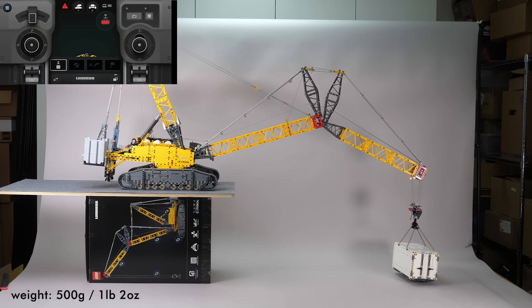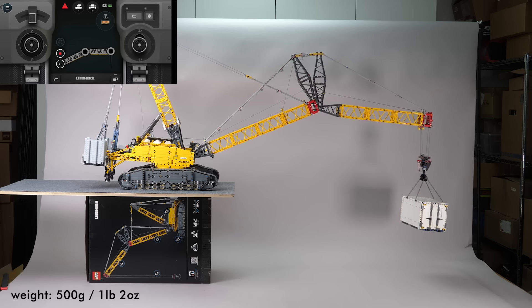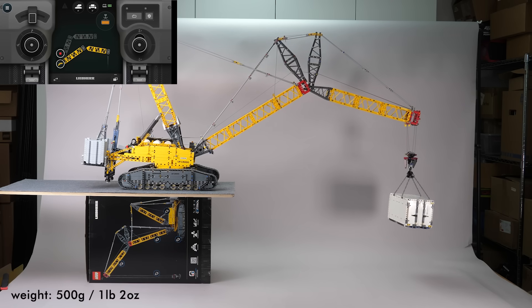Let's try it the other way around on an elevated platform. This is the lowest position — as you can see we are already in red, even with 500g of load. If I slowly bring it up and back, it will turn orange again. From this I can conclude that with the stock counterweight, if you want to comply with the safety measures, you can't fully extend the boom and jib even with this load.